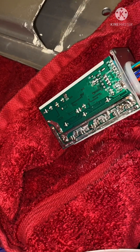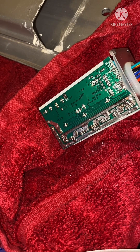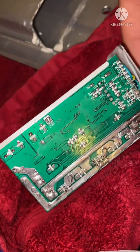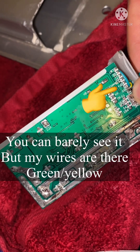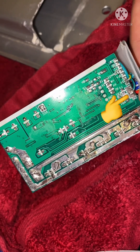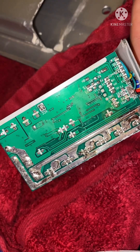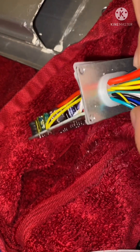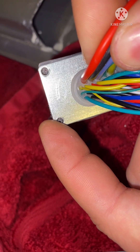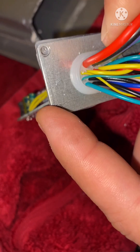Just a little hack, a little modification. I was paying about ten, eleven dollars for the step-down converter, so put that money back in your pocket and use this route. I already had the setup done on the five volt — I soldered a piece of wire, then for ground another piece of wire. I put the green for ground because that's normally what it's supposed to be, and then the yellow for power, running out right here. It just happened to be two open slots and I slid them right in there — super neat.